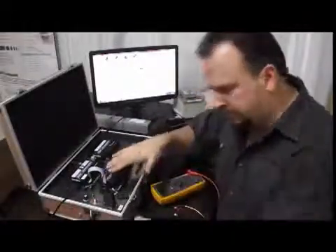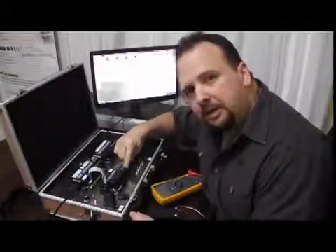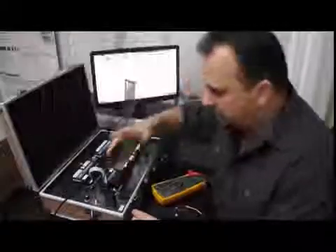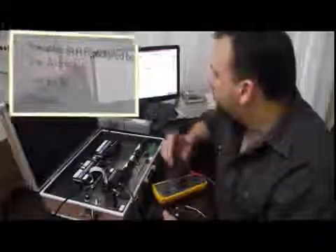Next I'm going to plug this into my analog expansion. I've got a nice wire made up, but before I plug it in I need to make sure that the little switch on the side is set so that input 1 will be on the 0 to 30 volt range and not on the 4 to 20 milliamp range. It is on the 0 to 30 volt range, so I'm going to plug it right in — and if you now look at the software you'll see how it resolves it.